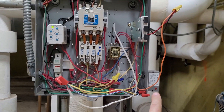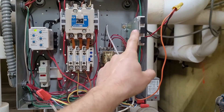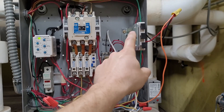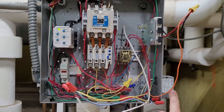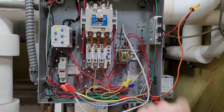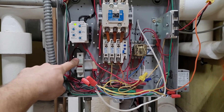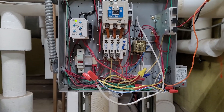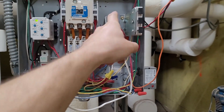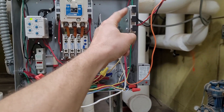When I added the relay I had to be careful where I tied it in, because I did not want to bypass the off function. The off function still needs to kill everything in case they need to turn the pump off for an emergency or need to work on it. So I tied my relay in parallel with the chiller contact. The way it works is it takes 120 volts from the breaker — the breaker comes with a fuse, and that fuse feeds the chiller contact which eventually comes to auto, and it also feeds my relay contact which again comes to auto.